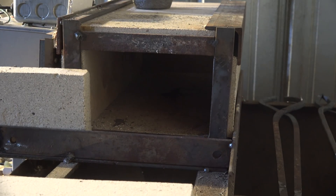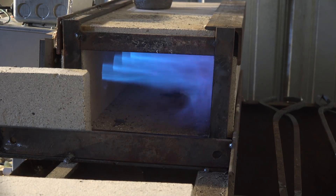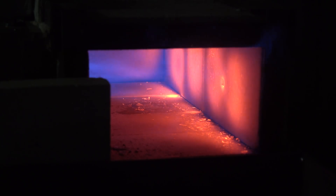We're going to be firing off here in just a sec. You've got all four burners coming on and they're going to start warming this thing up. Here you can see the holes I cut in the brick — there's two bricks there. I've got four holes in it to line up with the burners and you can see them starting to glow. They're glowing partly because of the heat coming off the back — the heat is turning the back bricks to bright red, almost yellow. It'll get hotter yet; it's been going six, seven minutes.